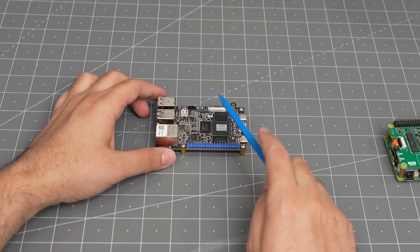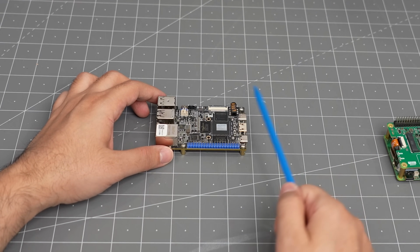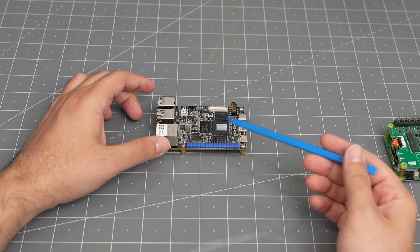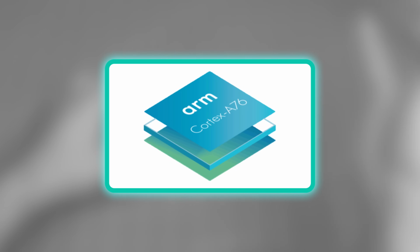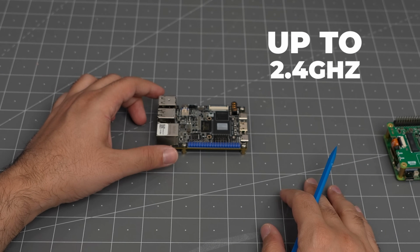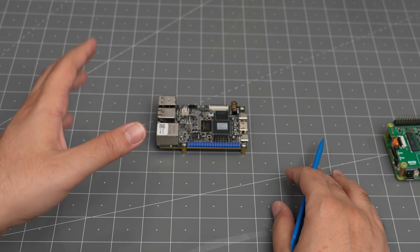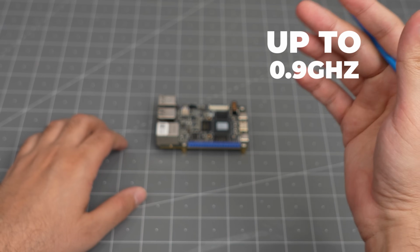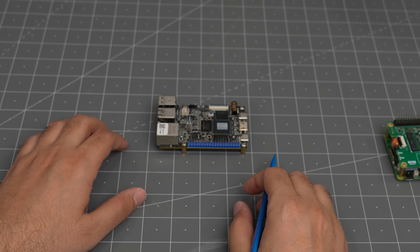This board, as I said, RK3588S. If you're a subscriber, you should already know that I have reviewed some other boards with the same SoC. And as you also know, RK3588S boasts four ARM Cortex-A76 cores humming at around 2.4 gigahertz for computationally intensive tasks, alongside four ARM Cortex-A55 cores, which clock up to 1.8 gigahertz. That's for efficient handling of mainly background processes and so on.